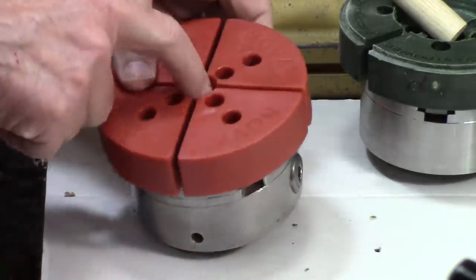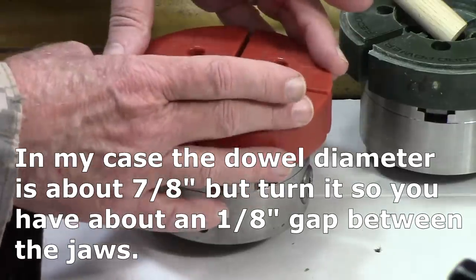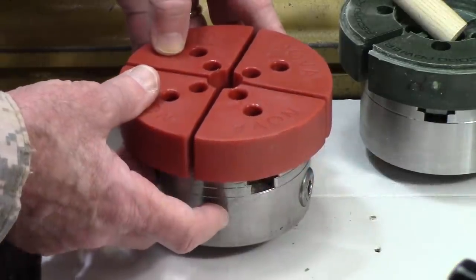And by tightening the metal jaw slides onto this dowel, it gives us a much firmer fastening, and it won't vibrate and the jaws won't creep while we mount this thing on the lathe to turn.